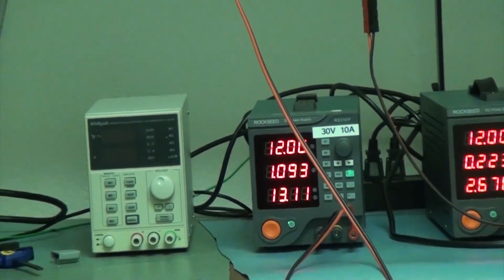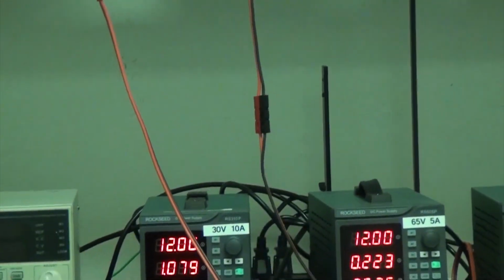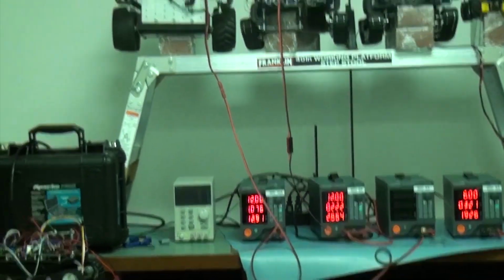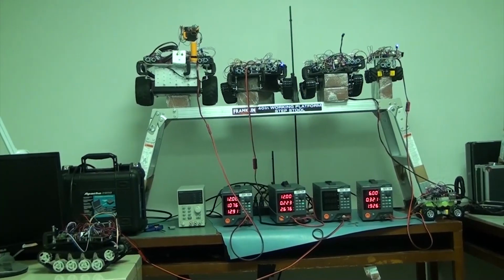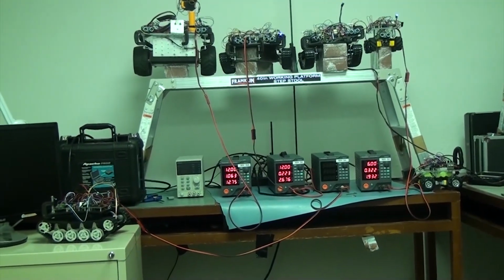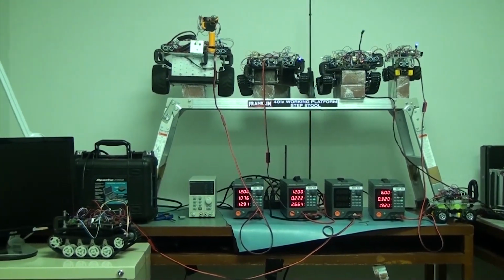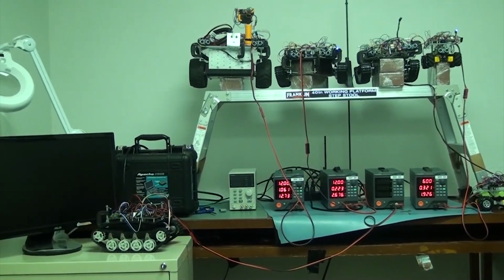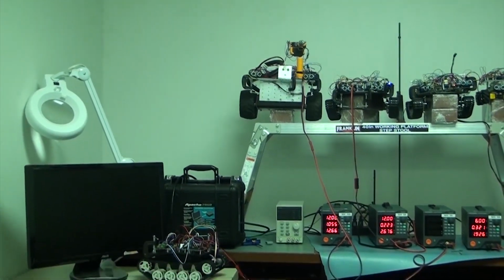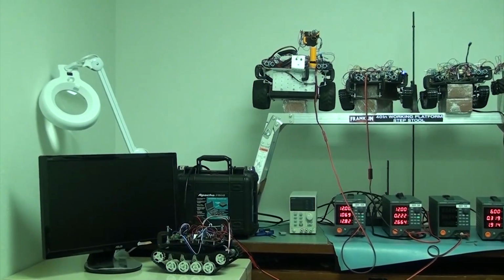So this is very good in all the robotics applications, is that you have a bench set up first to verify all your algorithms, and then make sure the power supplies are current limited. So you can make sure if things go sideways, you can limit the current and shut it all down. Also, it's very important to be able to monitor the current in wattage and relate that to the mechanical movement in terms of the increase in power consumption based on obviously the mechanical movement here.